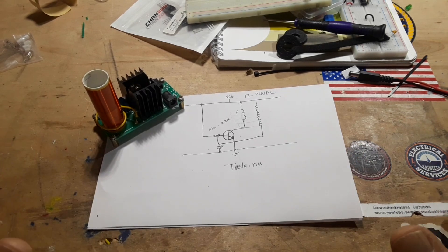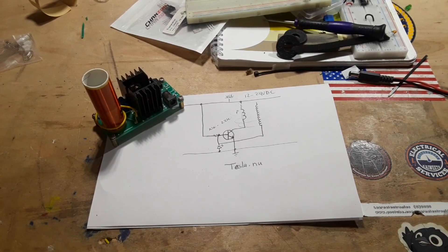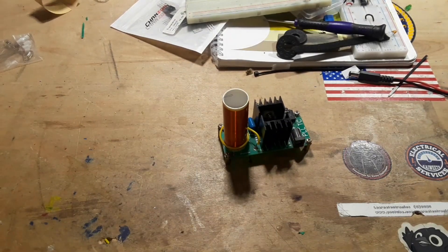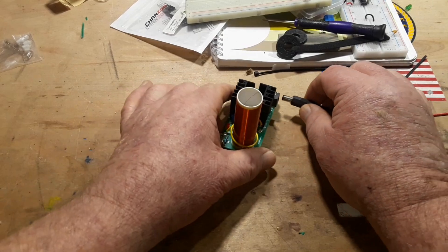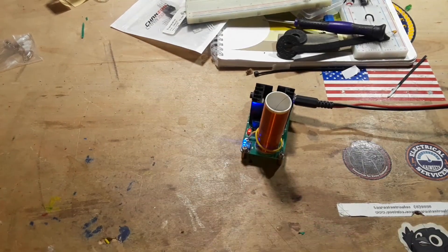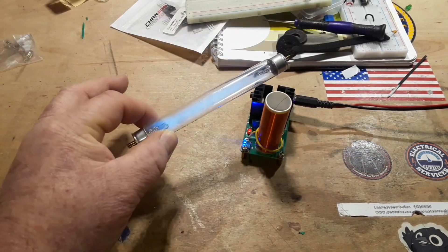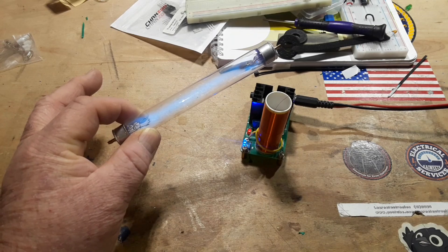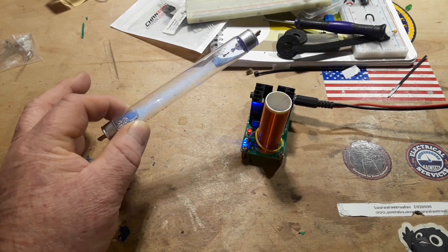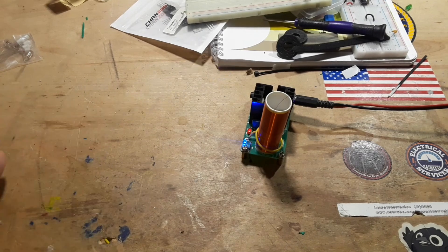Getting it to oscillate is not hard; getting it to oscillate well requires some time and tuning. Here's this dinky little Tesla coil — let's plug it in. It's fired up, and here's a fluorescent UVC bulb. As you can see, it's running on 27 volts, pulling 0.93 amps — about 25.2 watts — and it has a really weak field.